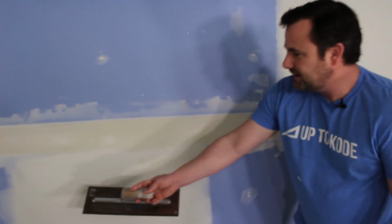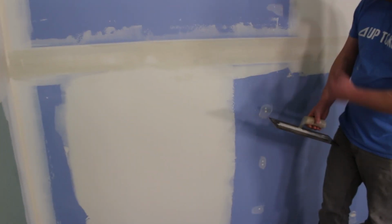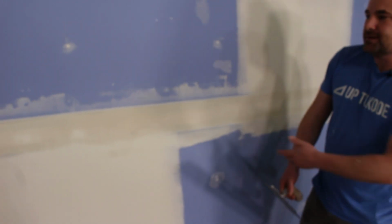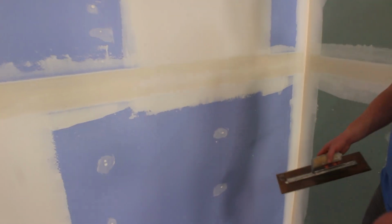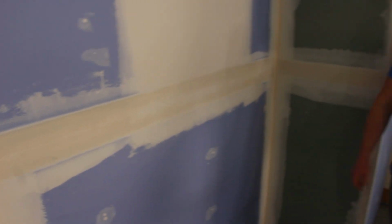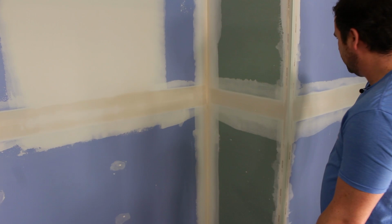And if you look around here, this is actually below this butt joint on the bottom side. It's all dry already. So Camille did a really good job just wiping that tight. It's blended in. We've filled what needs to be filled, and anything else doesn't actually need mud. And even here, you can see how it's dry right across where I brought my butt joint down. And it just fills what it needs to fill, wipes everything tight, and that's why it's nice to use a trowel. So everything's looking really good.